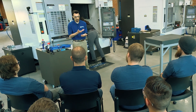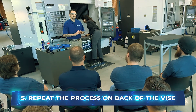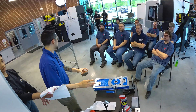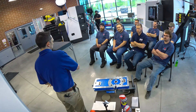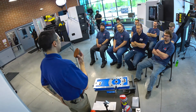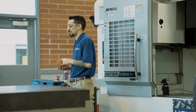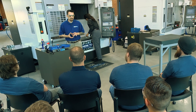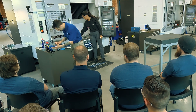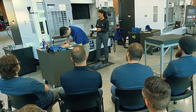Once she does it on the rough side, she's going to flip it over to the finished side of the stone and do the same figure eights. We're going to do the exact same thing to the vice. The reason we're doing this is because we're trying to make this vice and that machine sit on the same plane — we don't want any hills or valleys in this vice or that table. The minute you start stoning and there's a chip anywhere on there, it is now embedded in the stone, and you can be scratching up your entire vice or your entire table. So it's really crucial to make sure there are none of those chips. There is a little coolant residue from the vice sitting on the table too long, but with the stone we did our figure eights and got all the high spots off the table.